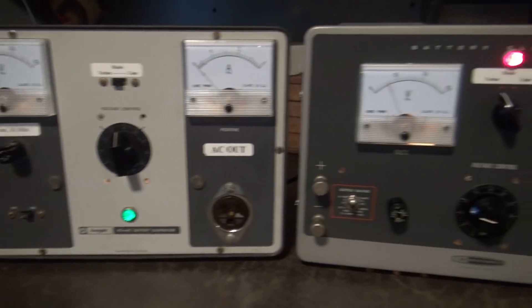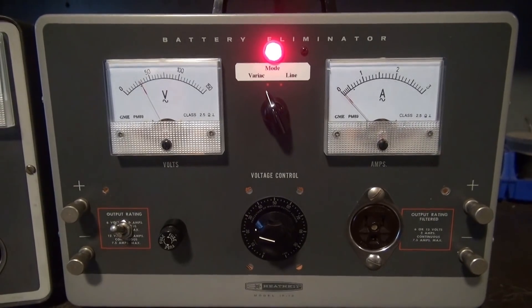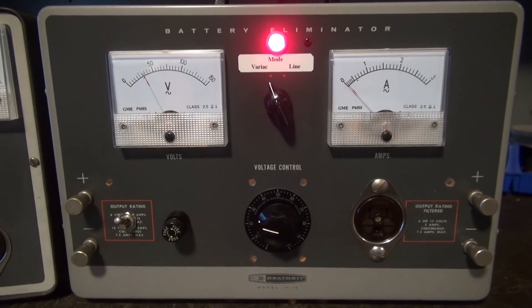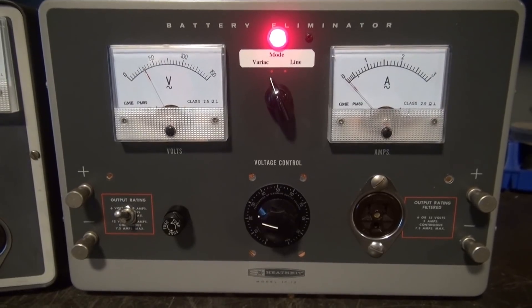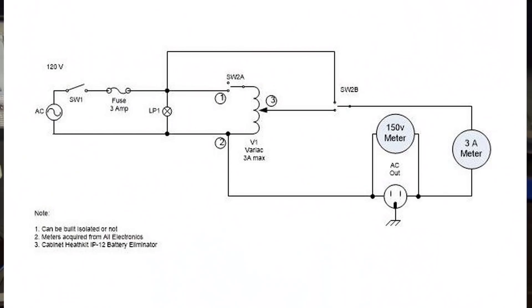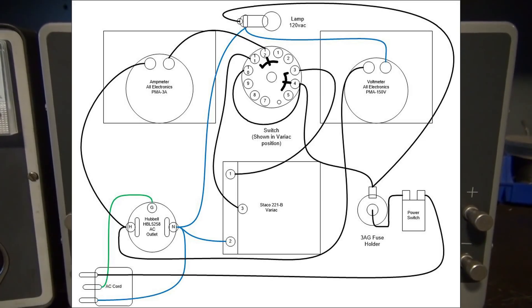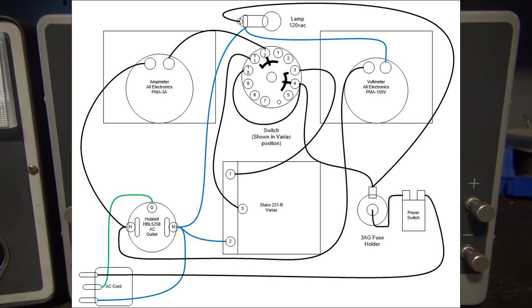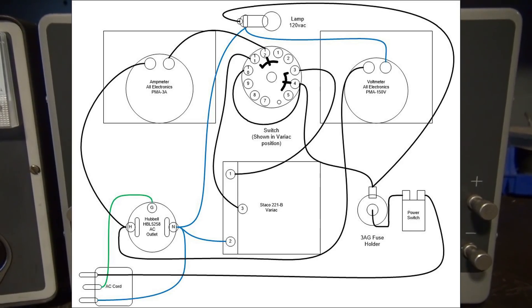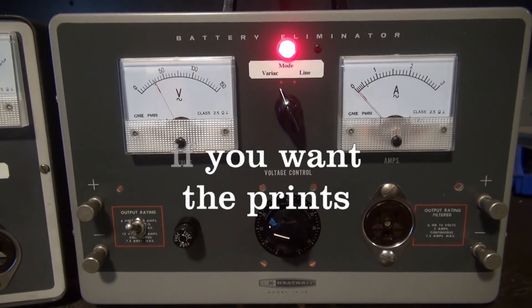There they are side by side. Started out with the Knight and now I've moved over to a Heathkit IP12 configuration. Inside it's the same — cosmetics are slightly different — but what a great instrument for your bench. Here is the schematic diagram that I promised. It's pretty much the same diagram as I posted before with a little more detail, but the best diagram is the line drawing. If you want to build one of these, just follow the lines and you'll have yourself a very cool variac for your test bench.